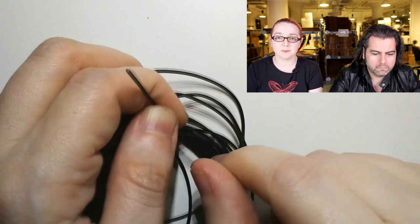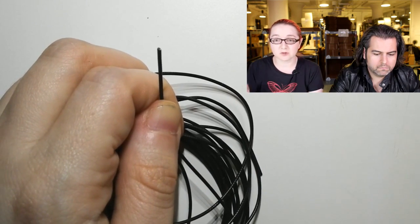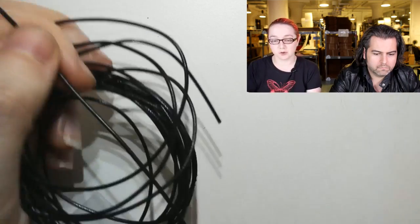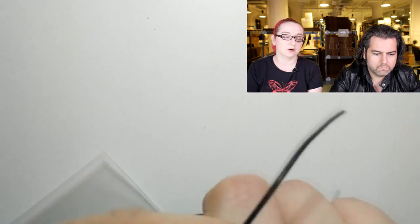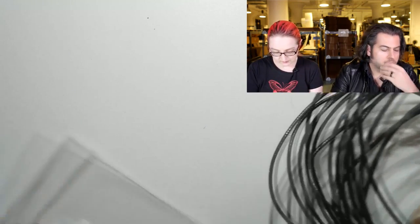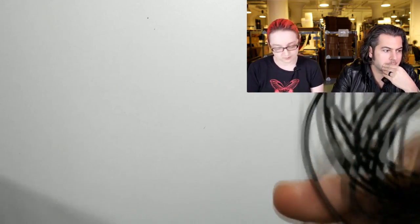And you want it to be shielded. This is really good. You can ground the shielding to the chassis ground, and then you have your wire going through, and it's less likely to get noisy or pick up stray signals if it's shielded. So yeah, this is called RG174U wire. Okay. Even though it's not wire, it's a cable. I don't know. I can't help it.